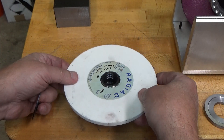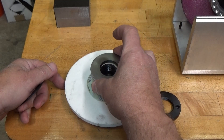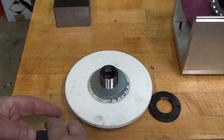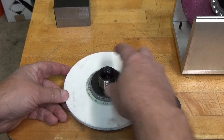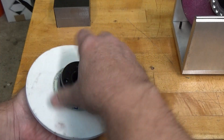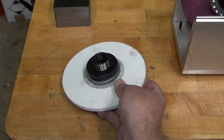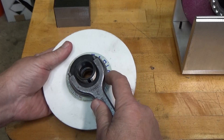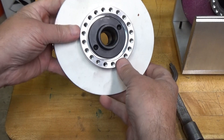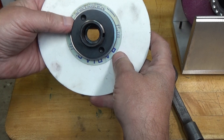I put the collar on and then the wheel. This particular wheel is only a quarter-inch wheel, so I have to use an extra spacer because the hub is not threaded all the way. I put my spacer in — that's the index washer — and then tighten up the nut. I use the spanner wrench to tighten the hub. So that's the setup: there's the balancing ring, which on my particular setup ends up going on the inside.